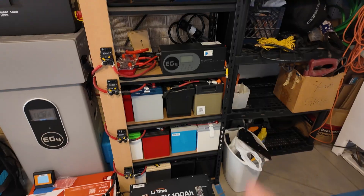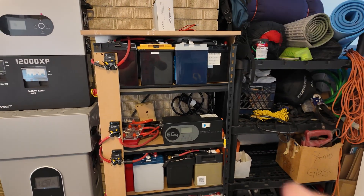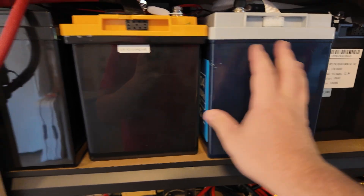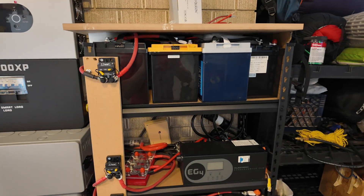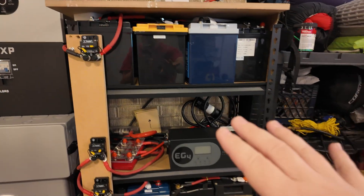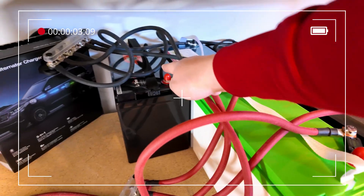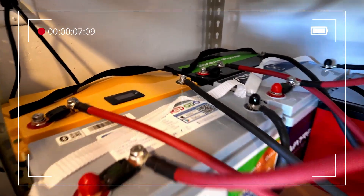I also want to emphasize that starting out at 12 volt and then changing to different voltages — whether it's 24, 36, or all the way up to 48 — you can still utilize your 12 volt batteries. You'll have to get at least four of them to hook them up in series, but your money is not wasted. I started out with a 12 volt system and it grew and became huge. I had pretty much all of these 12 volt batteries hooked in parallel in that system — I'll leave a link to that video in the description below.